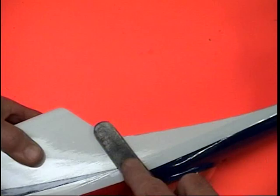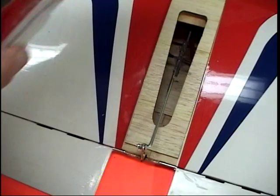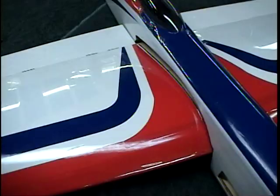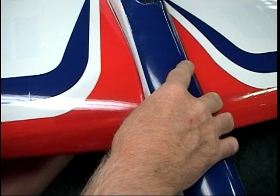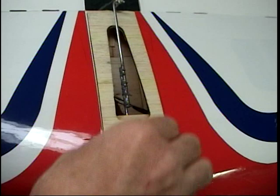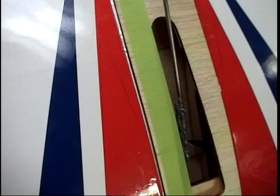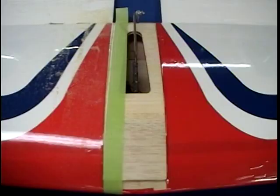Now let's see how much we've got to get. Here's the wing — this is pretty much a snap fit, but it's got to go over that wood. As I go to fit this, one side is nice and tight, but this side needs to have just a little bit of material taken away. I'll guess not much — just the slightest amount. Just take a tiny amount of material off this edge so that it's like a notch fit. It's about a sixteenth of an inch. I use the Dremel tool and a sanding block to get the last little bit so that this is a tight fit.